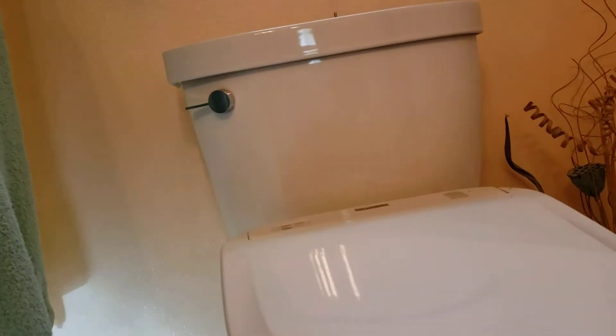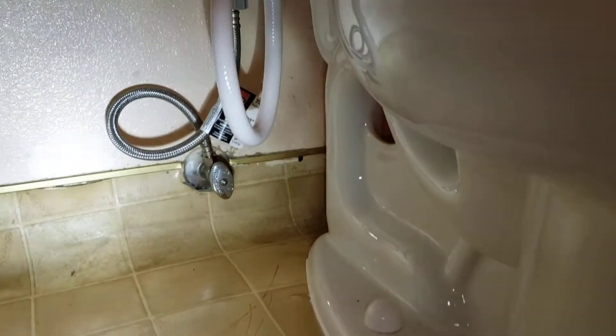We like to fill those gaps so you have some support — on both sides you've got those filled in. Then we got the tank set, water hooked up, and tested it for flushing. It flushes correctly, fills correctly, shuts off correctly, so that part is good. Looking back here right now you can see no water.